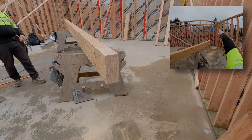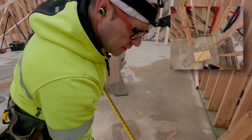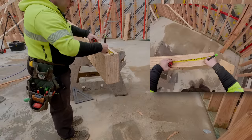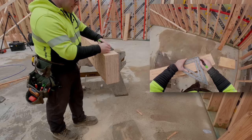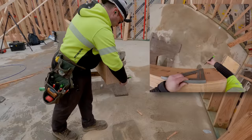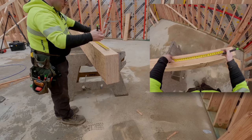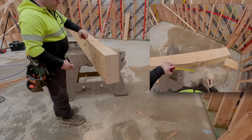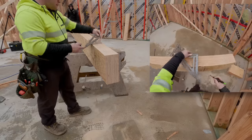My layout starts from there, 12-inch on center, and my joists are inch and three quarters. Since I'm on a 2x6 wall, I'm going to mark that so that I pull my layout from the inside edge of the wall. So 12-inch on center — it's 12 to the center — 7 eighths each way represents the flanges on my joists, inch and three quarters. I'm going to mark that.